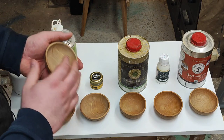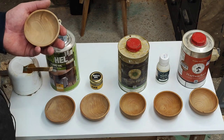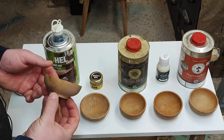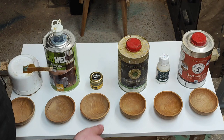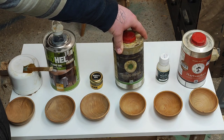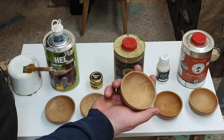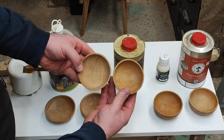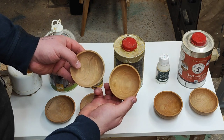It's like there's nothing on it, and I just washed the bare wood. That's the feel, and that's what I expected, and that is what I used when I started making bowls. And like I said, I didn't like that look, especially after you washed it, versus when I make utilitarian items, I just put pure linseed oil. Sometimes if I'm in a rush, I put the wax on top. Even with the wax, it doesn't wash off to this state like the mineral oil, so it still has some color in it. Maybe you can see it here, mineral oil versus linseed oil from Oli Natura, how much this still has color in it versus this one.